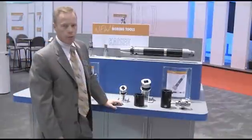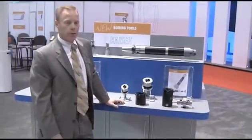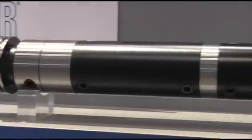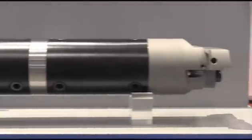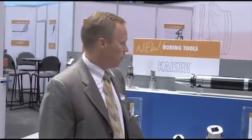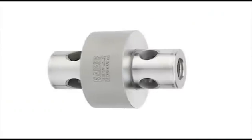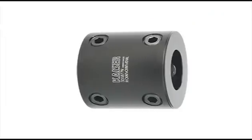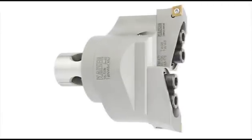The CKN tool system was developed with the idea that aluminum tool components could be combined with steel components to greatly reduce the tool weight and tool moments necessary for the machine tool to handle the tool more effectively. Here we have a build up of a tool made from steel — the chrome looking parts — and aluminum, alternating with steel and aluminum, all the way to the finished boring heads or rough boring heads that we can attach to.